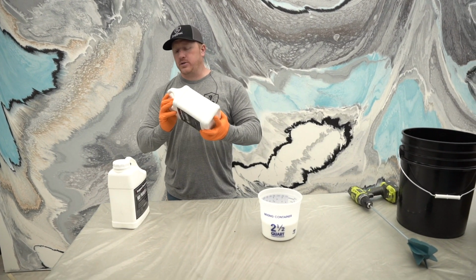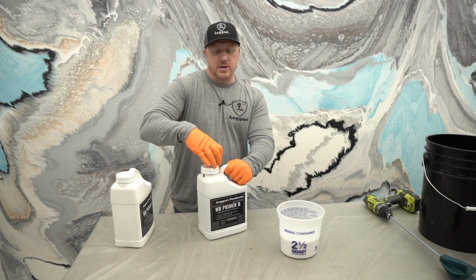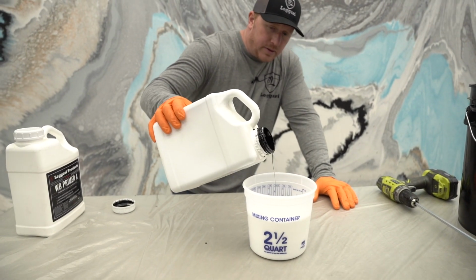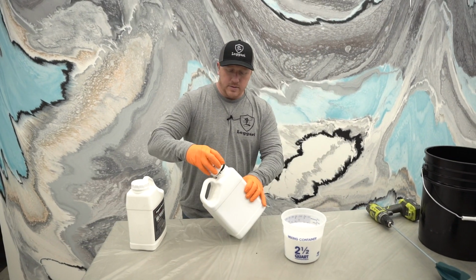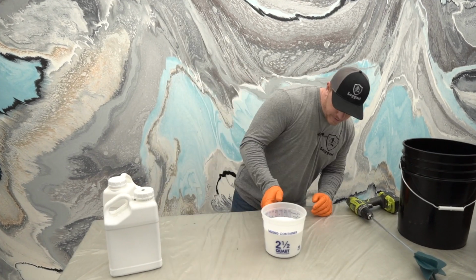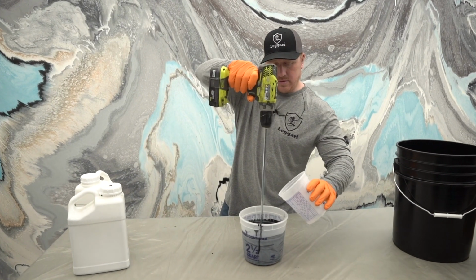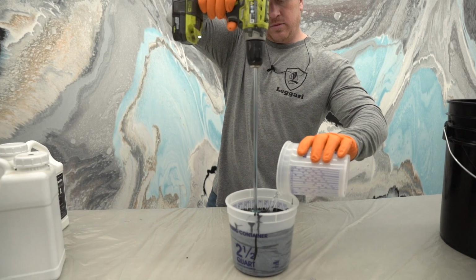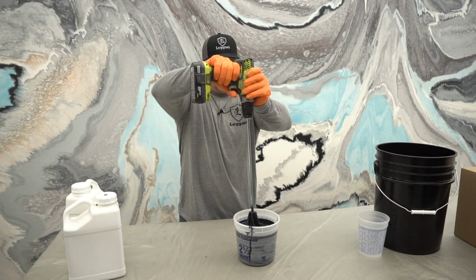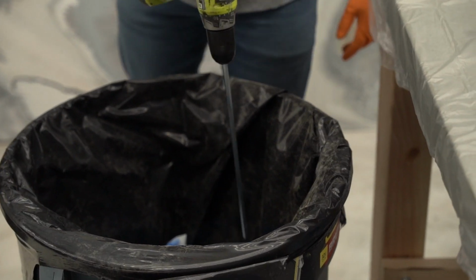We're gonna do a black base. You can do a light gray base or a black base. Either one will work. And when I say base, I mean primer. So we're gonna blend that up a little bit, and then we're gonna add our 10% water. All right, we'll spin this drill off in a garbage can and then we'll prime that floor.